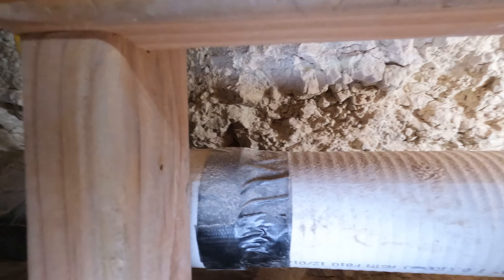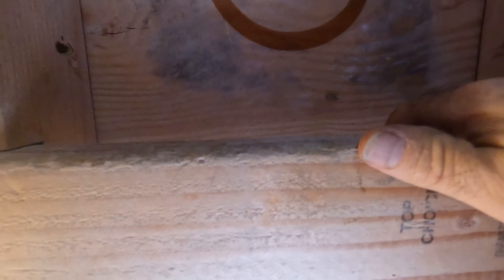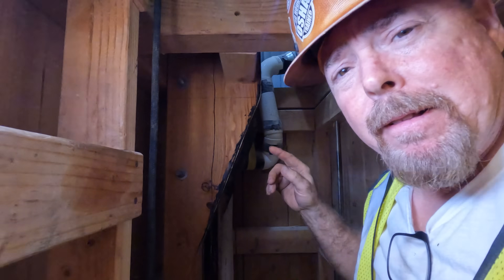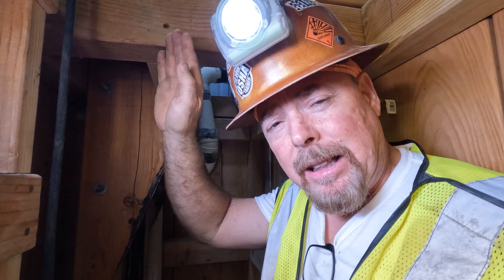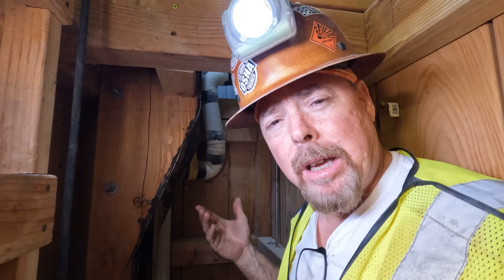We're going to go topside — I'm going to show you how that works. 40 feet of ladder — yeah, that'll test your mettle each time. Now, if you're running a vertical shaft with a skip bucket, when that skip bucket gets close to the top where it's going to dump, you need to get the butt of that skip bucket out. If it goes up and you try to latch it in to dump it, it might just sit there swinging in the wind.